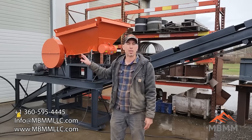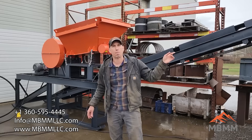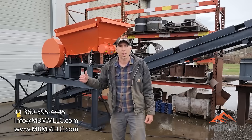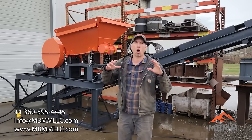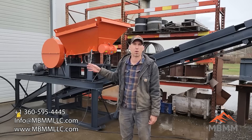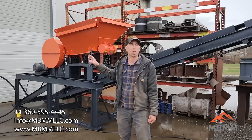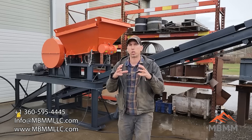The jaw crusher is run by a 10 horsepower three phase motor, and the vibrating motor and the conveyor belt motor are also three phase. The conveyor is two horsepower, and the vibrating motor is about a third of a horsepower. This is all 480 volt three phase power. The module can easily crush five tons an hour or more, but we like to put the 8x12 module on our two ton per hour turnkey system so you have the capacity to crush a little bit larger ore.